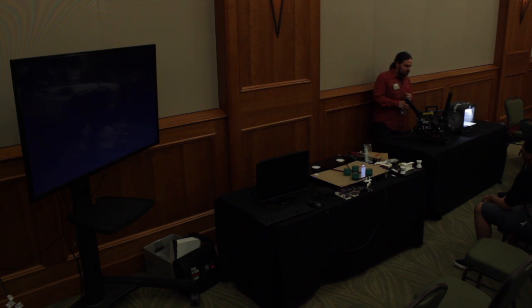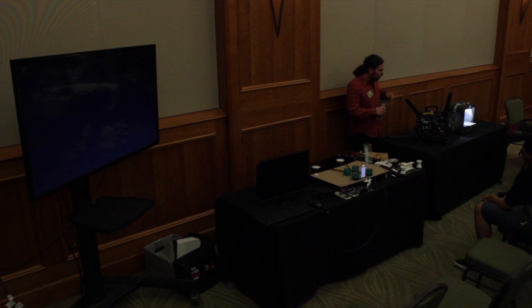So there's a community of people that hack projectors and will actually use machine vision cameras to do film scanning. They'll swap out the motor. Inside here is just a DC motor, and we're using stepper motors on the actual scanner. With the stepper, you have a lot more precise control.